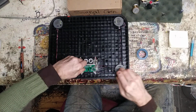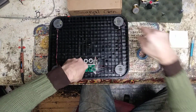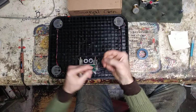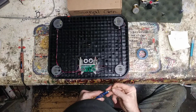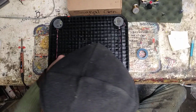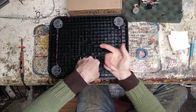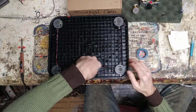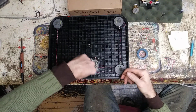The actual resistances they use, typically with a setup like this, there's set resistances that each one uses. Like I said, I tried to measure that, but I was getting voltage on each one, and it kept fluctuating down to tiny, like 20 millivolts, and bouncing around to 0, where it couldn't hardly get a steady reading. It was all over the place. So it's very tiny readings I was getting. But there are set resistor values. It's usually 120 ohms. Then the next step up is 350 ohms to 700 ohms, and then finally you top it off with 1,000 ohms. So it all depends on the different load cells.